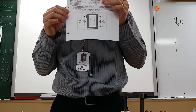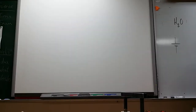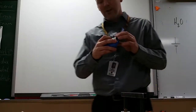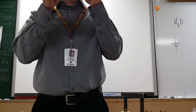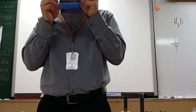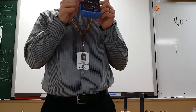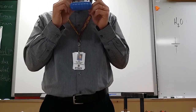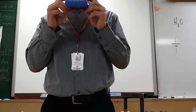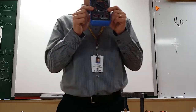So across our source. When you're doing both of those, since we're dealing with alternating current, we have to use the little parts of the multimeter that also have the alternating current symbol, the little tildes next to them. So when we're measuring current, that means down in the lower left, and voltage is down in the lower right in both red and green, but not in the ones that we're used to using for DC.